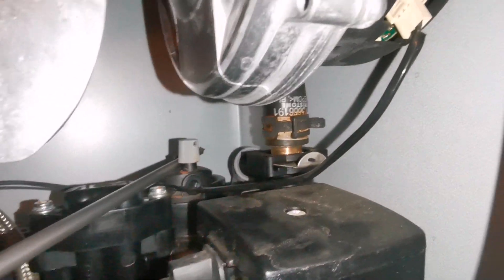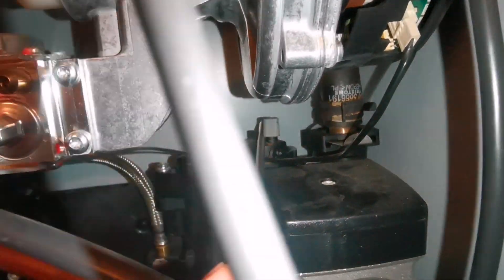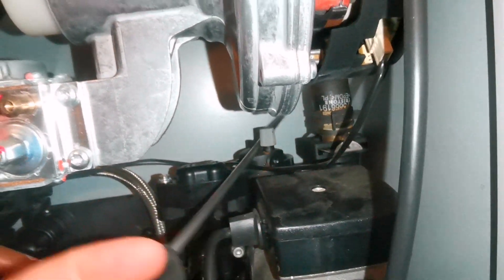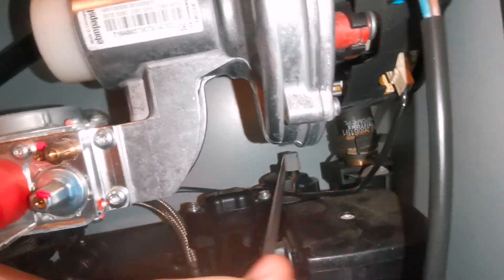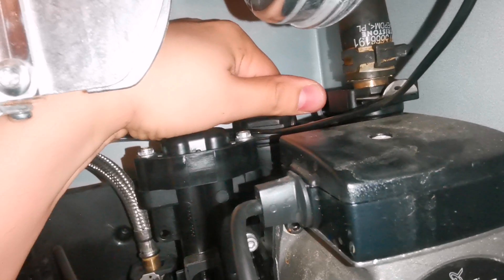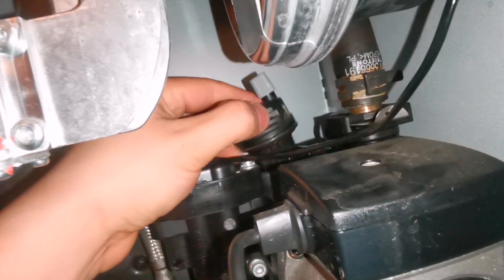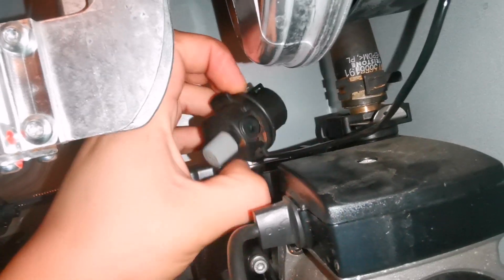The first thing I need to do is get out that AAV. Place some sort of screwdriver and just twist in between those two points — that is the easiest way to do it. An Allen key is also a pretty good tool to use because it gets into nice small spaces. With some Worcesters that's a really good trick — to use an Allen key — because these AAVs that twist off are notoriously difficult.